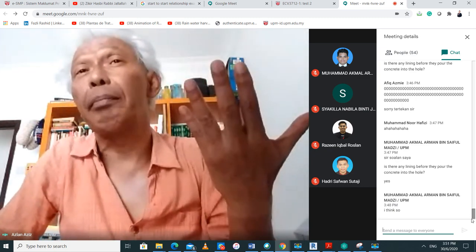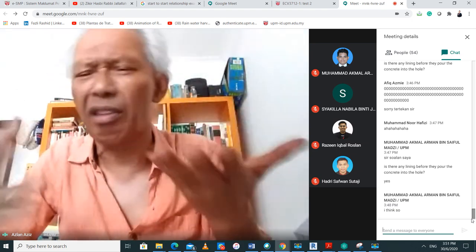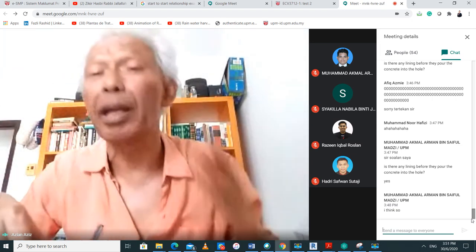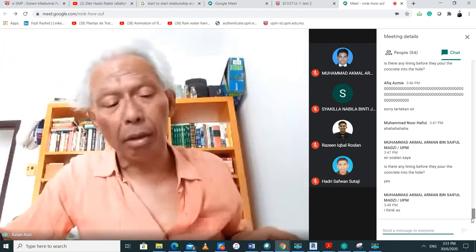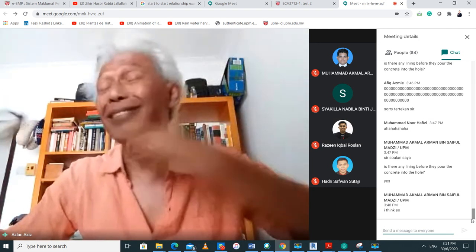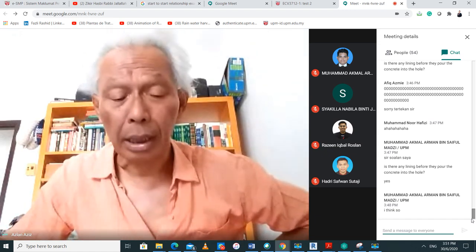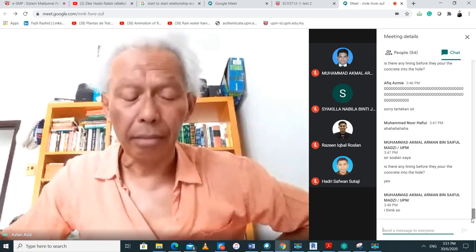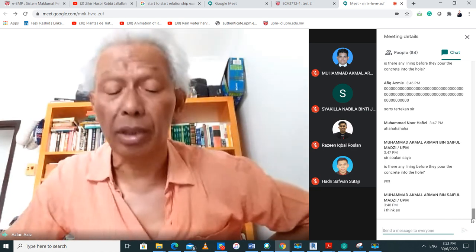This is just background knowledge. All right? If you read the book sometime or you read the code, sometimes they say large displacement pile, small displacement pile, and sometimes you don't know. So I'm giving you all of that in advance. Now, general comments: pile lengths in general are between 10 to 60 meters. These days it can be like 200 meters even, because technology has made it possible to have high strength concrete and all that. And in general, the load it is taking can be 200 to even 2,000 kilonewton.